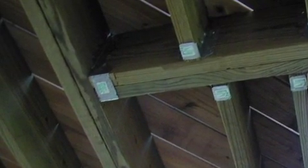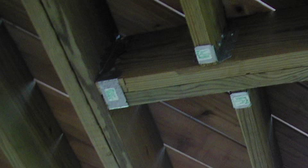This deck does not look like it fell from the ledger — it looks like the beam cracked. The beam on the outer edge carries a lot of weight from the internal framing. If they just used a single member, you could see where it would stress and eventually fail. There are probably some missing joist hangers, or maybe some rotted joists also. For decks, a beam most often is simply doubling up the joists wherever weight is being transferred. You see it done twice here — the joists on the right being carried entirely by the beam running horizontally, and that beam being held by the beam running up and down on the left.